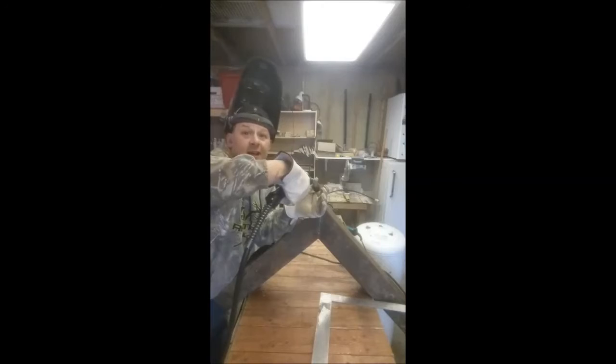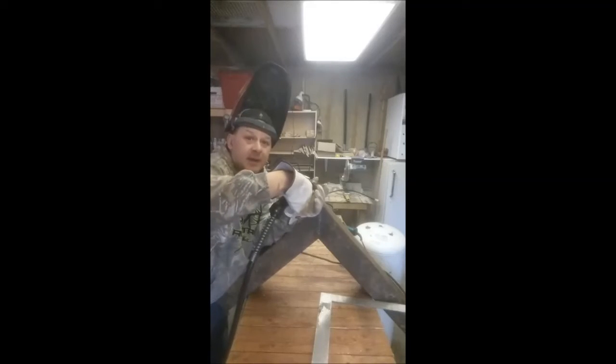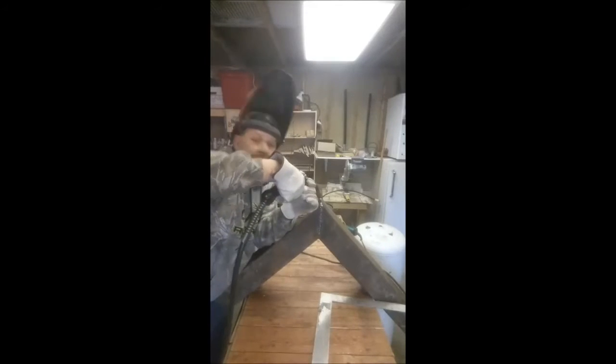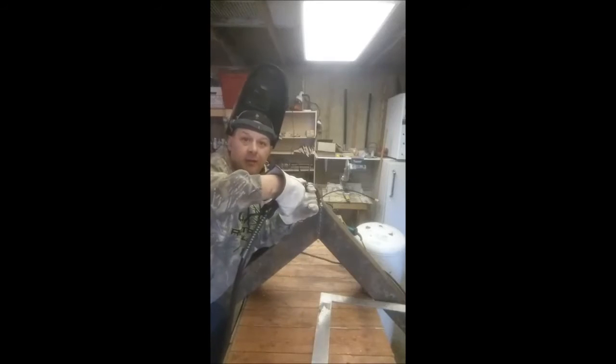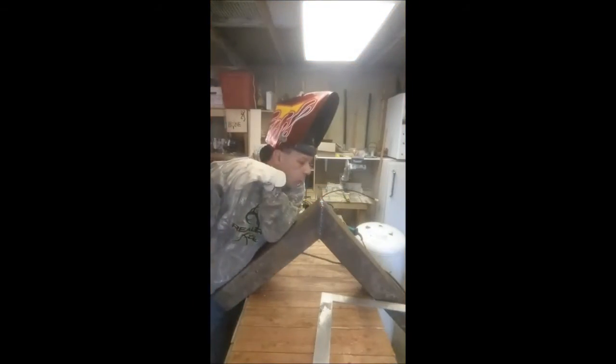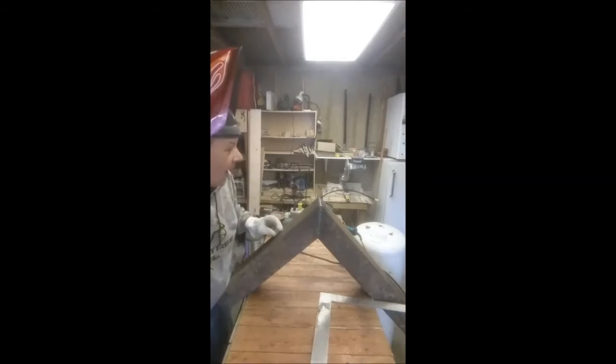I'm bridging quite the gap here, so I'm having a little bit of a hard time. I'm just using a little briefcase MIG, so I'm not hooked up to a big power supply or nothing, so just doing the best I can, boys. Because other than that, this wouldn't be Dickard with Dave now, would it? That, and she'd work a heck of a lot better if I had 220 out here, but I don't, so I'm only using 110. Yeah, look at that slop right there, eh? Wow.